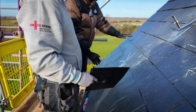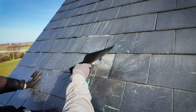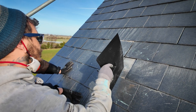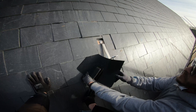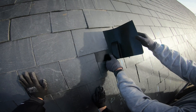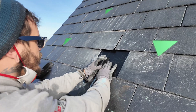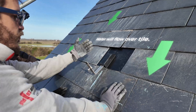These are always a pain because as you can see there's a nail here. When I'm pushing it in, the nail is going to catch — sometimes it catches. As you can see, you can't really get much on these. We might get away with this one — nice, straight in underneath. Push it all the way up so it's in line with the tile. The hole you've made is now covered — it's watertight.